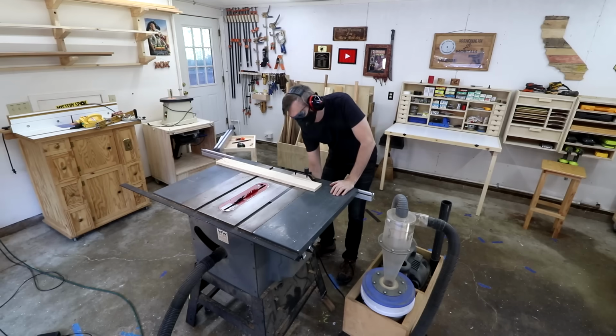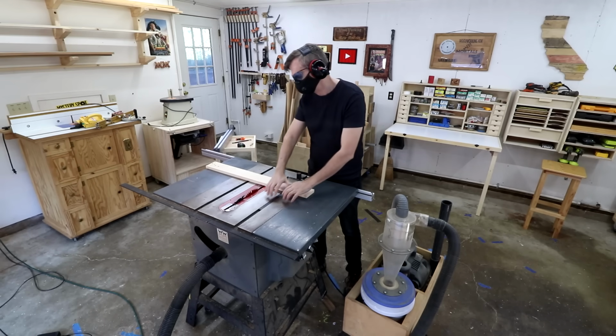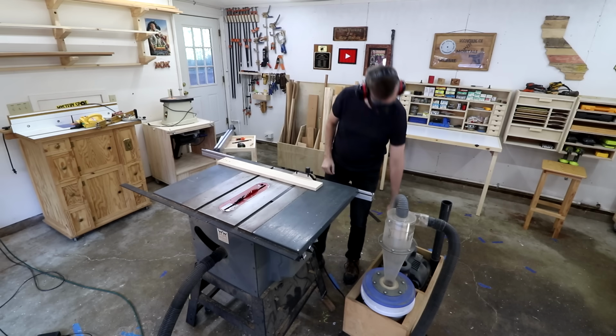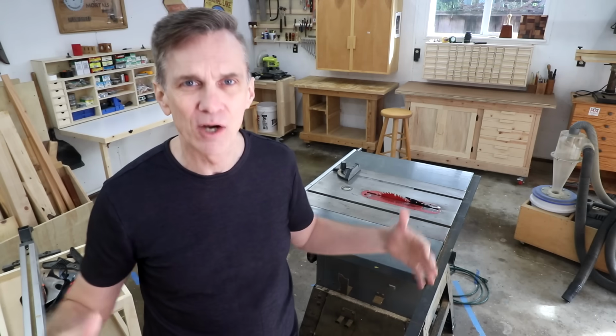How are you going to turn on the saw? How will you hold the wood against the miter gauge? Where will you position your body throughout the cut? What will you do after the board is cut? And most of all, imagine where your hands will be throughout the entire procedure, from the moment you turn on the saw to the moment you turn it off. Establishing this habit will become even more important as you learn to make more complicated cuts.